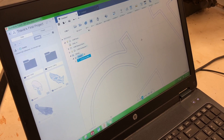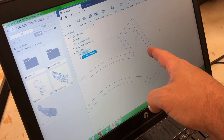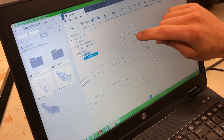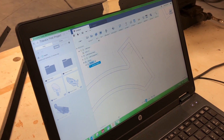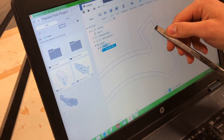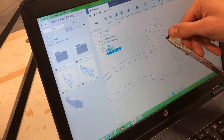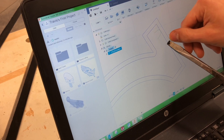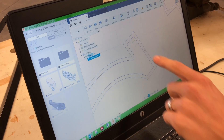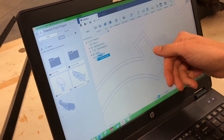For people who don't understand offset — what's going to happen when the plasma's cutting is it's actually cutting up to that line, this blue line right here. When this torch is firing, if this is the width of my torch, my torch is going to be in the middle of this blue line that's cutting. This outside edge of the torch that's firing is going to be this outside edge — so it's going to leave what I've originally modeled. This width is determined by what you set up in that setup — the 045 nozzle diameter. So that's essentially half of that.